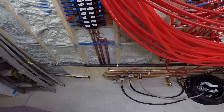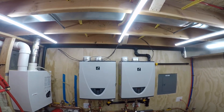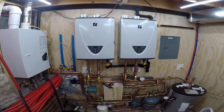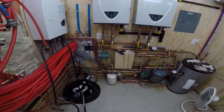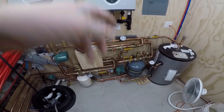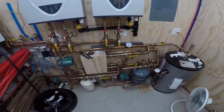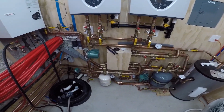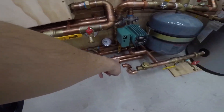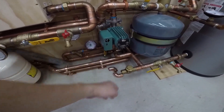Temporarily, because I do not have the venting hooked up yet, or the condensate lines hooked up, and I have not filled any of this or leak tested it past that cold water valve where the water will enter the hot water system. I still have a couple joints on the recirc line back behind there that still need to be soldered, and then I need to put a 90 in and come up a 90 into this.